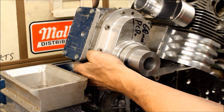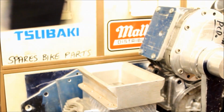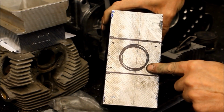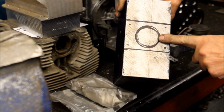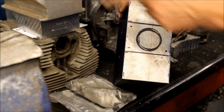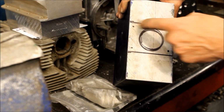See, on the Eaton, them ports are quite massive. And on this, all you need, just in marker pen there, all we need to do is, because it'll have a 1 3/4" carburettor on it, we can just bore a 2-inch hole in it. Right, okay. And flow that into the impellers of the supercharger. We can just have 4 bolts.